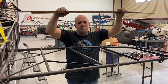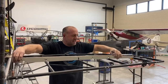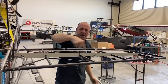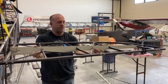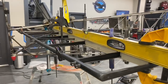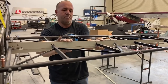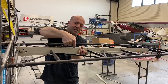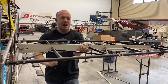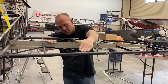So I'm going to cut this out and show you what it looks like. Done. So this is like magic — that part now notches around each one of these, and then this one goes to the bottom, and you can see we can pinch that together. What I'll be able to do now is I'll micro the honeycomb back together. I'll put an I-beam top and an I-beam bottom, micro these back together, and then run glass around the I-beam, down across the joint, back across the bottom I-beam. Fill in all these and make it tight. And this will become a permanent I-beam in the horizontal. And then the carbon can make this oh-so-gradual arc.